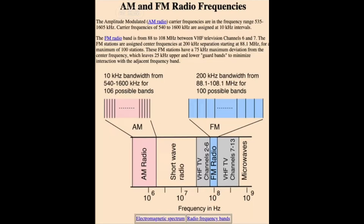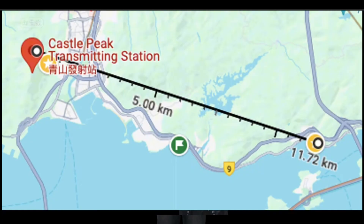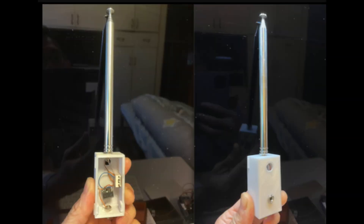What are the differences between an AM Crystal radio and an FM Crystal radio? A medium-wave amplitude-modulated crystal radio can operate at distances longer than 20 kilometers. It's difficult to get an FM Crystal radio working at that distance. An AM Crystal radio requires an antenna and an Earth connection will help, but an FM Crystal radio does not require any Earth connections — adding one will actually make things worse.